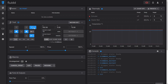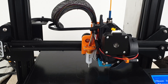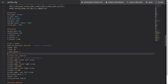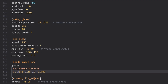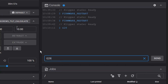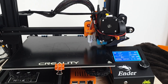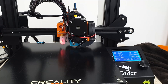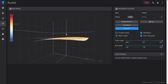Let's try to home the printer. So far, so good. Now I configure auto-bed leveling by adding a bed mesh section to the config file. I also add a G29 macro to emulate the Marlin G29 G-code, which is not available in Klipper. To perform auto-bed leveling, I issue a G29 command in the console. Fluidd provides a graphical tool to visualize the result of the bed mesh leveling.